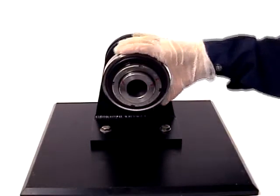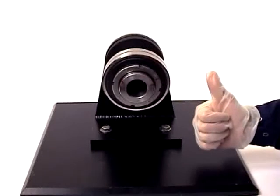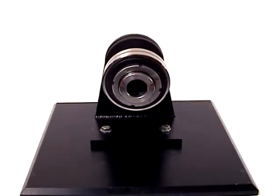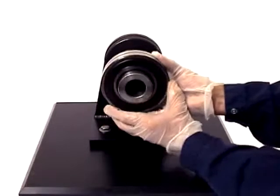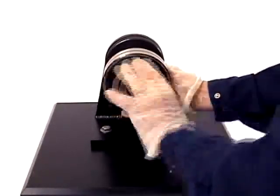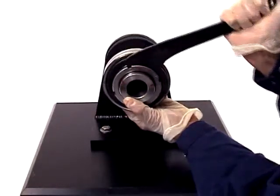Note that for large bearings this can be quite difficult due to the weight of the bearing or shaft and drag losses resulting from grease and the seal. Installing a sealed spherical roller bearing is not difficult and can be done quite accurately if you take your time, follow the correct procedures, and use proper tools.